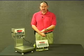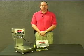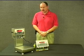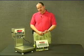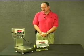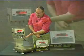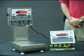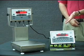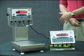The open design of the base itself means that in a wash down environment, everything just washes right through — it's all open in the bottom. There are five overload stops on the unit: one in each corner and then one in the middle on the bottom of the cell. The column itself is designed so that everything washes off — it's all angled design. It's installed with four large bolts, two at the back and two underneath, plus the two feet at the back of the column, making it very rigid and sturdy.